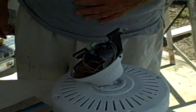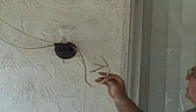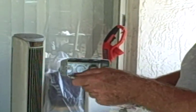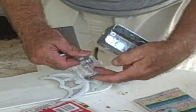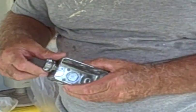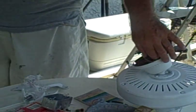The other thing where we're very fortunate here is the fact that when we took this out, we had electric wall sockets along here. So we have a basically a live power line right here. So we'll use this to run a junction box and run it to the fan. What we need to do with that is, since that's an existing length of wire, we'll have to mount this electrical box up on the roof, run connectors into the box to hold the wire, and then run the new wire down to the fan. And the fan will be hooked up with its existing wiring.